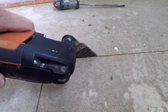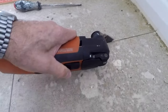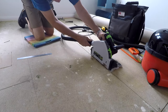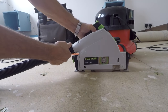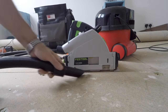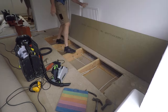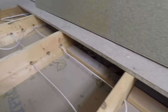I tried my multi-tool first — it didn't work very well, the blade was too small and it was far too noisy. Then I tried cutting along the joint with my circular saw; the gap between the boards tended to guide the blade, but there was a chance of going off-line and I didn't want to risk a kickback. So, not wanting an accident, I decided to use the track — which is what I should have done in the first place.